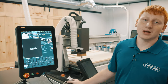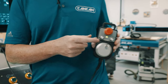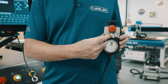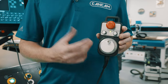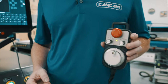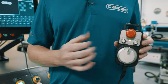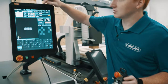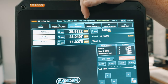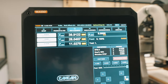The last type of manual control is the MPG. On the left-hand side, there is a black dial that says off XYZ4. This is your axis selection. Turn the dial to the desired axis and you'll be able to control that function. The dial on the right is our step size selection and it will say ×1, ×10, ×100. Now these are not step values, but if you look at your screen directly above your F3 jogging page, it will say MPG axes, followed by the axes you're controlling, as well as the actual step size you have selected